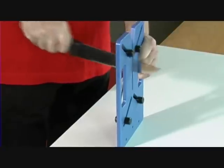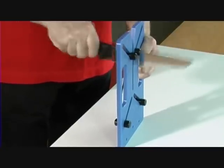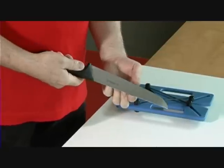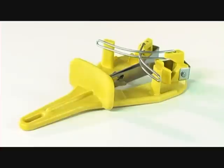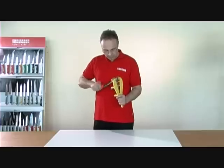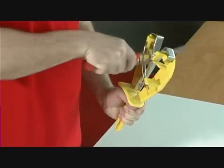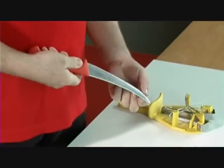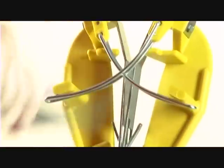If the cutting edge or the microscopic burr simply needs centering or honing, then a few strokes in the upper polishing section of the bars should be sufficient. Or there is the Sharpen Easy knife sharpener, with which even beginners can obtain perfect results when sharpening blades. With this tool, the end of the blade is inserted as far as the guard and then drawn downwards whilst exerting a gentle pressure. The blade only goes as far as the end of the guard or to the V end. The procedure is repeated several times.